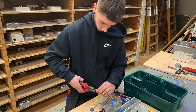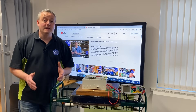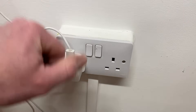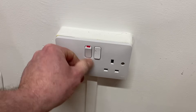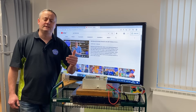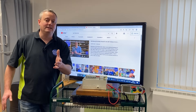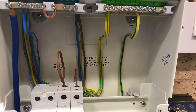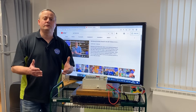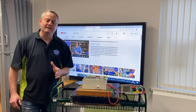Often at college we're working on small wooden boards and the precautions with insulation resistance testing involve removing all loads — disconnecting our lamps, neons, and unplugging things from socket outlets — making sure all covers are on and screwed back, and our switches are left in the on position before we start our insulation resistance test. But when we step back and look at our rig, the conductors that should be connected during this test on our small wooden boards won't be present. As we move through levels one, two, three and onto our apprenticeships, it's important that we understand there are certain elements that need to be in place before carrying out this test.